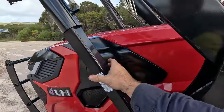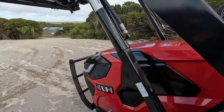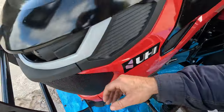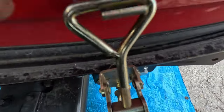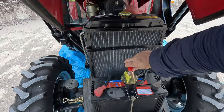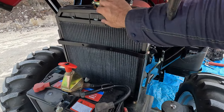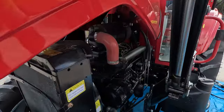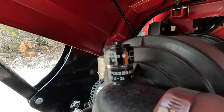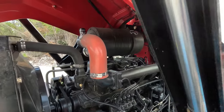These plates are stored up on there but they rest against the hydraulic rams to stop anything falling on you if you're working under it. Get the bonnet open. First thing I'm going to do is flick the isolator off so nothing comes on me. I've got this mesh screen on here protecting the radiator but I'll give that a bit of a clean. There's a little indicator there which shows you if the air filter is blocked - it sucks against it and displays red - but it looks pretty clean. I'll pull out the air filter and give that a look.